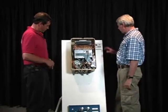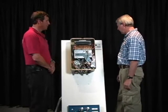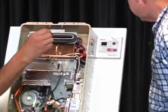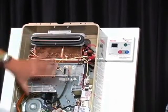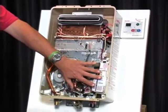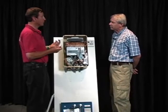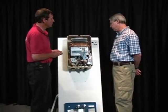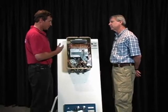Well, the controls here we'd see inside. We wouldn't see those outside. Correct. And the control is a digital control, and it does have a program button whereby we can find out a lot of things about the unit. If it has ever shut off on any code, again, what the computer does is it regulates the system. If, for example, someone were to shut the gas off to this unit, a code 12 would flash here. The homeowner would come down and see it's flashing a 12 and call, hopefully, the technician who put it in and say, it's flashing a code 12.